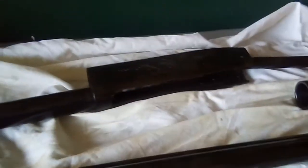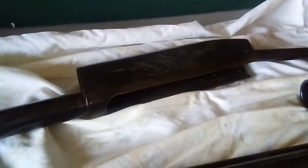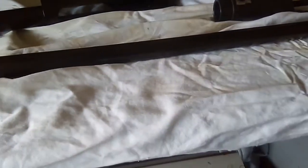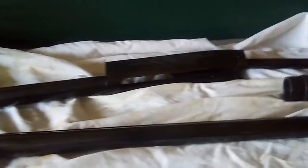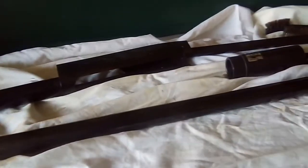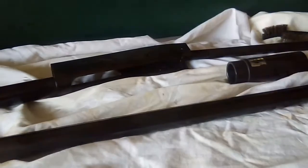I went through this Remington 1100 semi-automatic 12 gauge shotgun where I re-blued it. During the degreasing, rust removing, and perma-bluing process, each step goes so quick that by the time you've done it, you have enough time to walk to where you're going to rinse the chemicals off, come back, check everything, dry it off - before I can even record it. Being new to this process, I don't have the equipment to let the camera sit safely and observe while I explain it all.